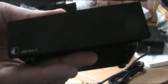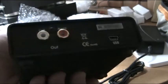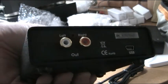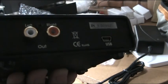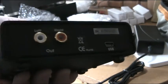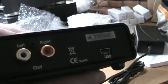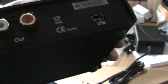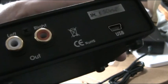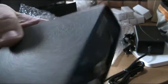There is also a USB Box S+. The S-Plus does require its own transformer because at the back it has optical and coax digital inputs. But even with that, it only achieves the higher bit rates through the optical and the coax. Through USB you can transmit CD audio quality — basically 44.1kHz, 16-bit. If you want to go up to 24-bit or any higher sampling rates, then you've got to go optical — you can't do that via USB. Bit of a shame, but it makes me wonder what's actually inside here, which is why it needs the power.